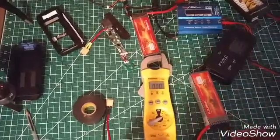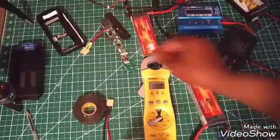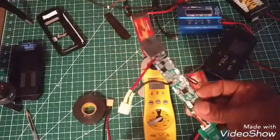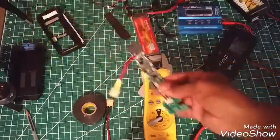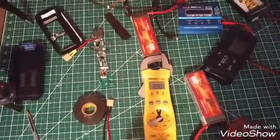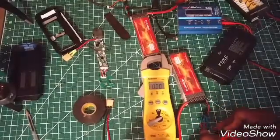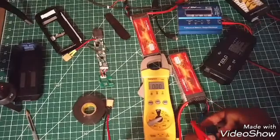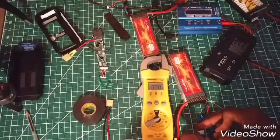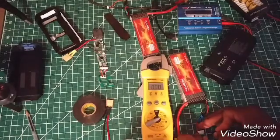What we're trying to do is match up the plug so we can use it with the electronics that come out of the Solo battery, and then we'll be able to use any LiPo, any 4S battery, for our Solo. We're going to take our ground wire, put the first one into the first slot which is ground, and the last one should read 16 volts.